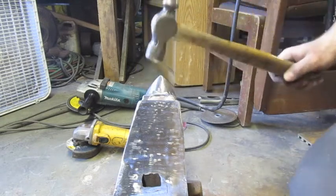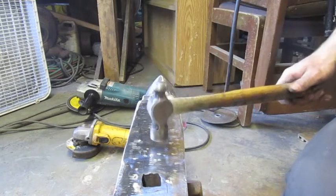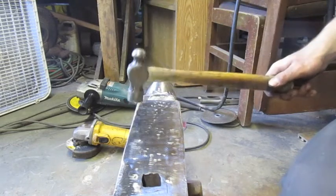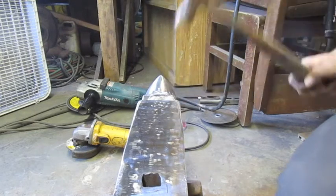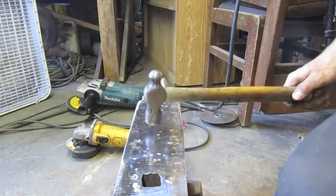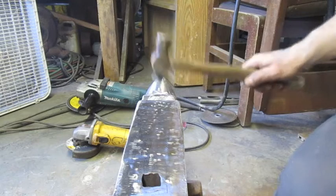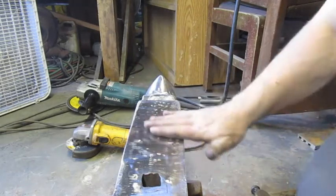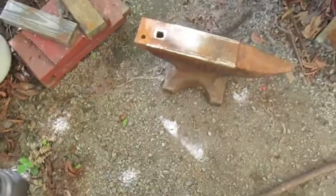Here is the hammer test for rebound. It is comparable to all the other anvils I have — not quite as good as my Fisher anvil, but it is still quite good. And I am hammering on the corners there just to improve the durability. I switched over to the ball side, and it doesn't really leave marks at all, which is good considering that the middle is still the original steel.